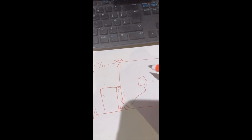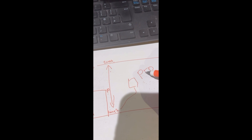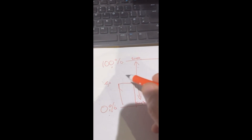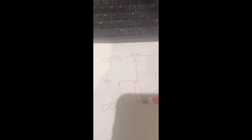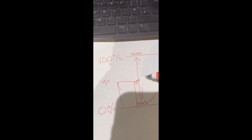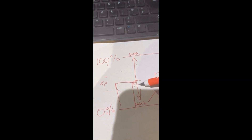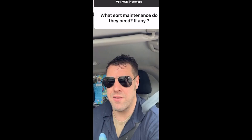When you get into this area, VFIs can also use what's called a PID loop — Proportional, Integral, Derivative. It sounds more complicated than it is. In simple terms: if you want to go from zero to 100 miles an hour and you want to hold 50, you press your pedal down to get to 50. As your car goes a bit faster you let the pedal off a little, then as it slows you put the pedal back on a bit — that is a PID loop. Have a look at them; they're really interesting and they form a lot of control systems.